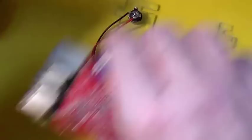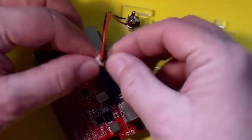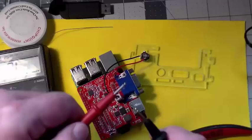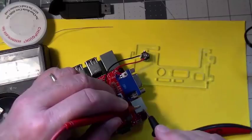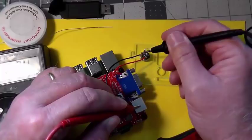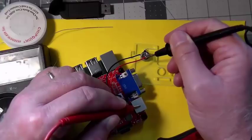I like to put a full 12 volts on this circuit, with power coming from the same connection that's going to the radio. So when you turn the power supply on to run the radio, you're also turning your Raspberry Pi on. Now we have a connection there just the way we want it. To make sure we've done it right, I'll bring in my meter and measure continuity. When the probes go together we get a tone. There's a beep, but it's not continuous because of all the circuitry in there — so that's a good connection.